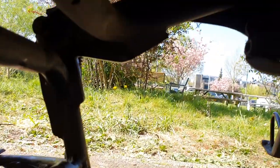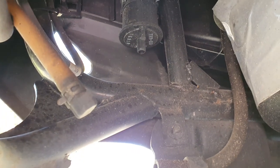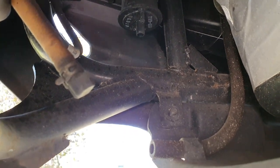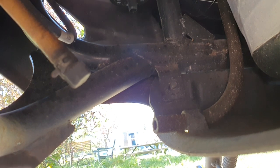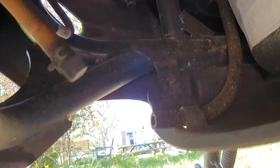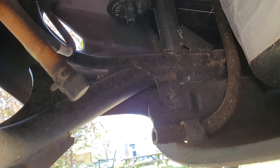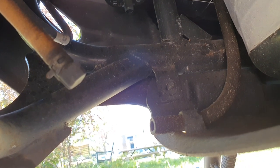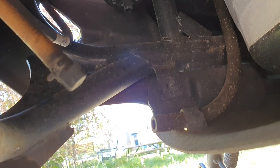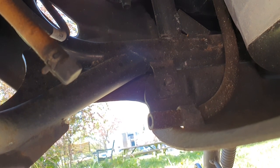The next thing is to clean the crankcase exhaust. I need a container to collect whatever comes out. This is part of normal maintenance. There's not so much in it, but you need to clean it. The crankcase exhaust accumulates rubbish from the crankcase — it becomes vapor and condenses into this tube, so it needs to be emptied periodically.